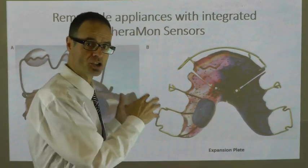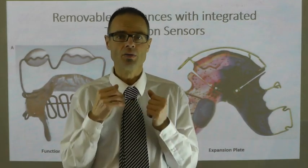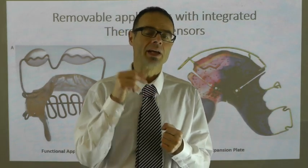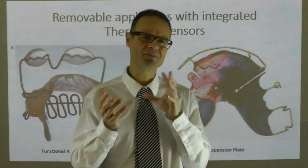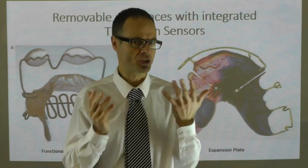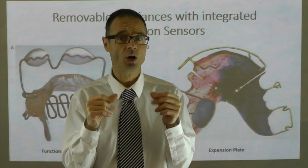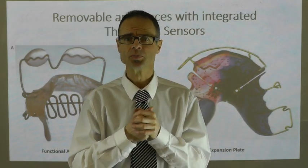Now, what the microprocessor does in other situations is during the day, the weeks or months between being read, the microprocessor wakes up every 20 minutes. When it wakes up, it measures the temperature. It then goes back to sleep again. By doing that, it can save its battery power and I find they last usually somewhere between a year and a half and 2 years. Sometimes only 1 year, but that's unusual. And they tend to be very, very accurate. We've had a couple of failures, but not many. Frequently, because I've drilled through one of them.